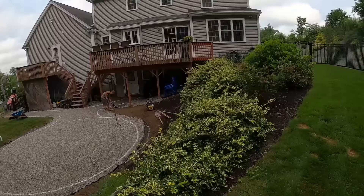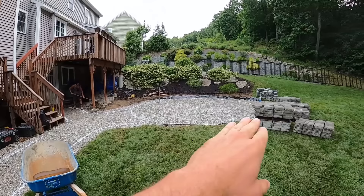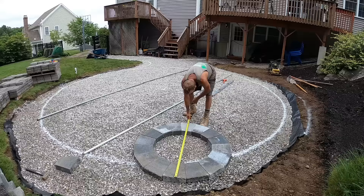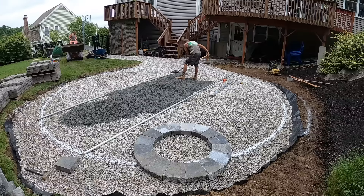That's going to be a really sweet area. Looking at it from the gate, everything will be level side to side, but it will be an eighth-inch pitch from back to front, also with this walkway — it's going to pitch this way. The first two pipes I put in are level side to side, and the second two pipes are set an eighth of an inch lower than the first set of pipes, which accounts for our water runoff pitch.